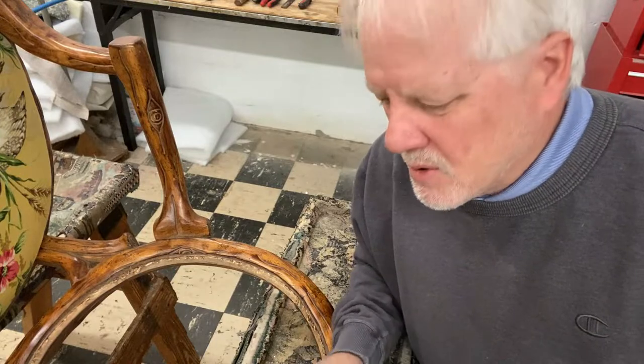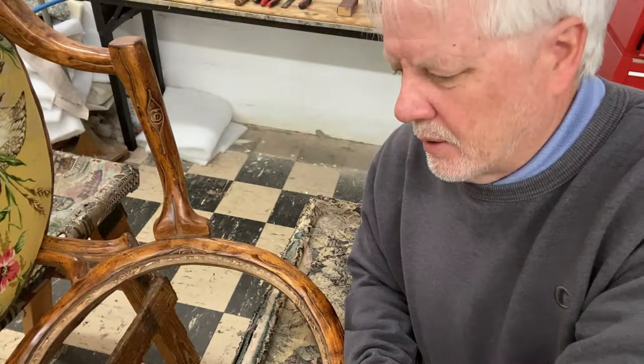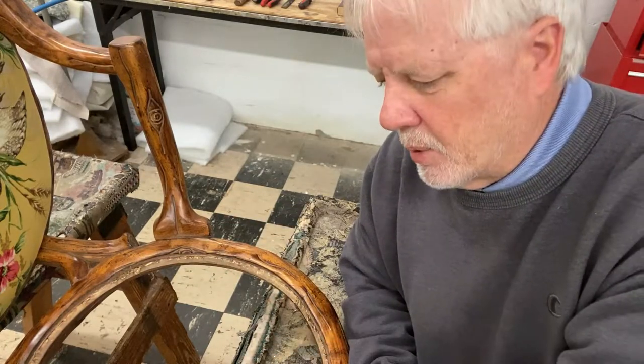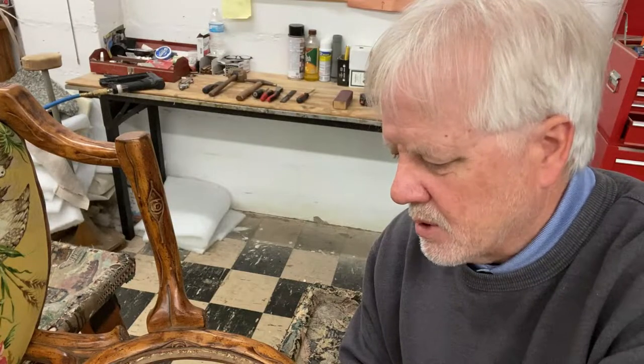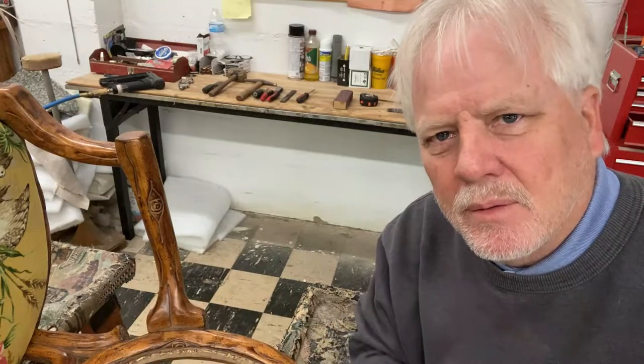The way they apply most of these wicker inserts is they have what's like a bead of wood in a groove, and they'll take some of the wicker that's woven up in a sheet, and they'll basically upholster it in here, and then they'll pry it in with that bead to secure it in for good. I don't want to take this bead out because to me it's just wood filler for me to staple into. So what I'm going to do is just cut the edges, cut this off, and you'll see as I go, I'm just kind of, like you would a razor blade on tape on a windshield, basically just scrape it off with the knife.